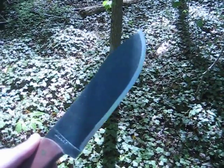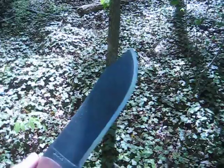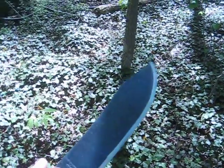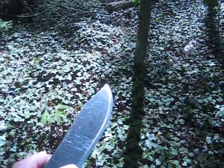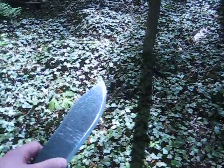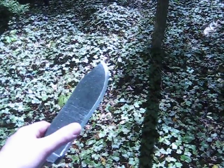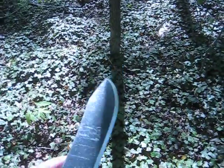Out of the box, the edge is not very good. This is 1075 series high carbon steel, and it comes with a somewhat convex grind on it. Basically, it was a highly polished edge, but it was not flat ground, V ground — it was a convex edge. I could tell that they had been coming along and then they sort of bumped the edge, and it would not even cut paper out of the box.